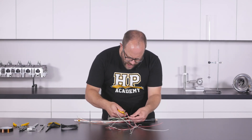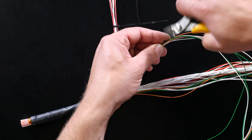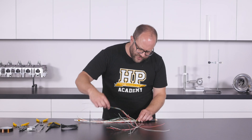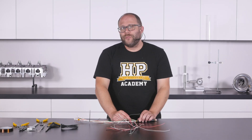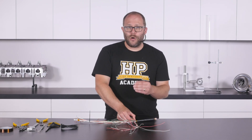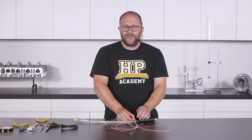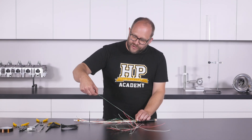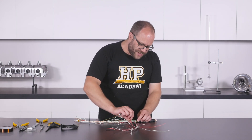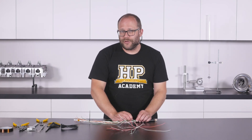Clipping our temporary cable tie out of the way here, being careful not to nick any of the wires underneath. We can now separate out into our individual branch sections. We have two pressure sensors and one temperature sensor, which means two groups of three wires and one group of two wires. In that situation, these branch sections are going to end up just twisted around one another, so we can simply branch them out individually and secure them with a little bit of Kapton tape.